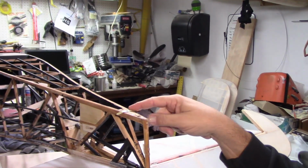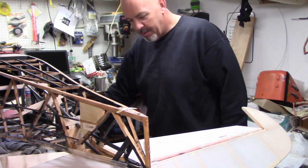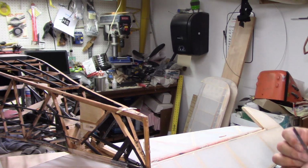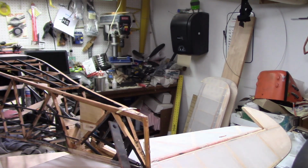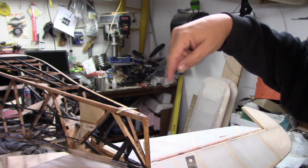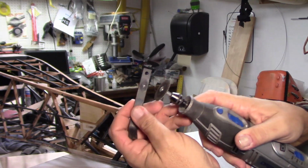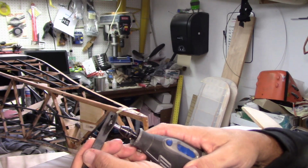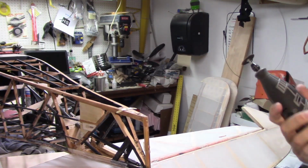So let me go ahead. And the other thing I did too, I got my little flying wire connector. And what I'm going to have to do with this, this is going to happen this morning too. I'll use the same little grinder. I tried drilling through spring steel. He just can't do it. So what I'll do is I've got to make a little spot for this screw head to come into. I'll probably just come in, just like I'm doing here, and cut out a little spot and grind it out, just so that this little screw head can cover it.